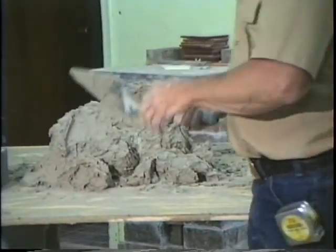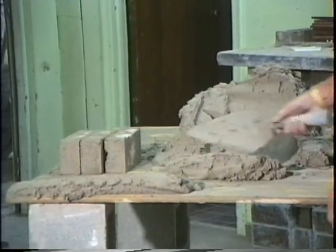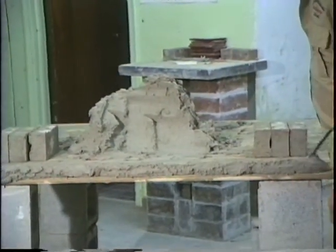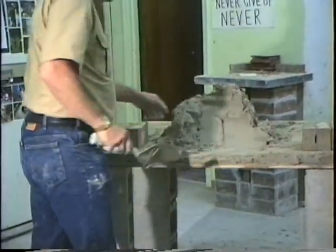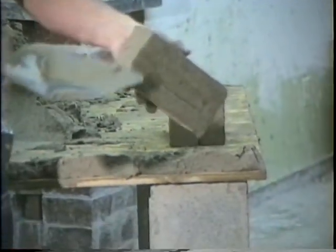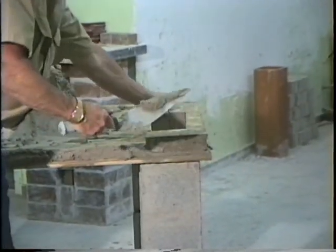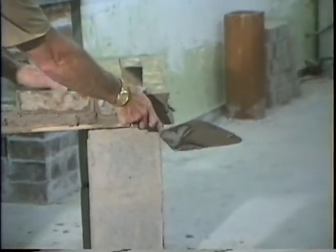All right. Now then, we're going to do it again. I'm going to back the brick here. Come forward. Bring it down. Need a little bit of mud. Get a little bit of mud. Come back over here. Fur the mud. Start up here because we're backing them in. Remember, the solid part of the brick, not the one with the groove. You want the solid part hanging out. It's going to be back about 3/8 of an inch. Cut that mud off. Back it down. Full head joint. Put your finger there, your thumb, so it doesn't fall off.